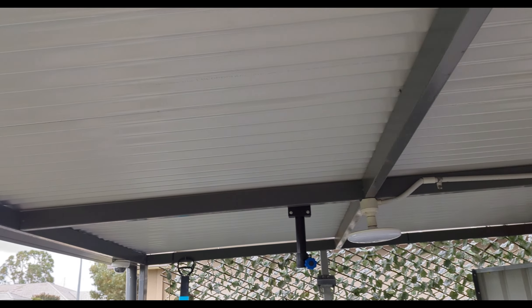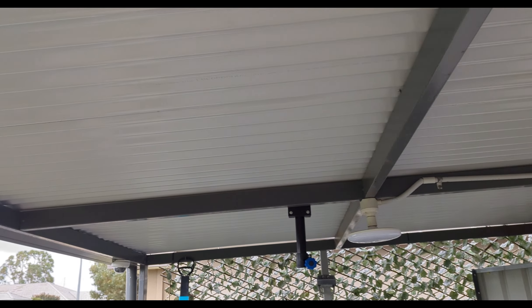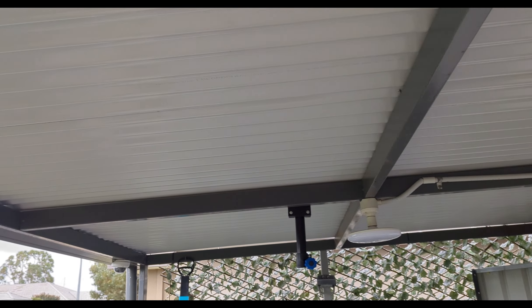We just had enough sheet to come to the edge - same on the other side. If I'd left a 100mm overhang and done two corrugations overlap I would have had to buy a whole other sheet for about 200-300mm, which would have been wasteful. That's not going to leak - that's how the old plastic one was, and it only started leaking because of the screws and cracks from age. This is tin now so it'll last for a while. Another successful project. It's windy now and it's not moving or making any noise. I'll check for drips when it starts raining. Cheers for watching.